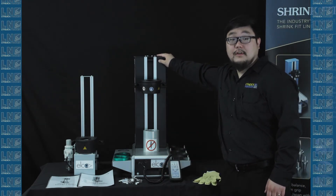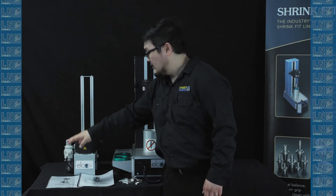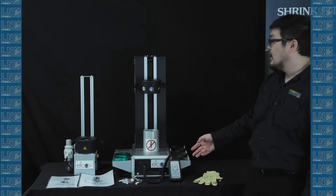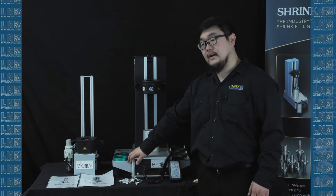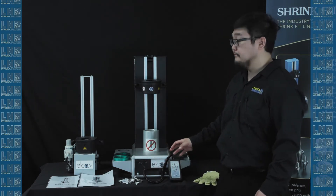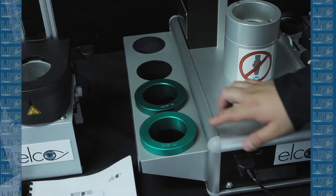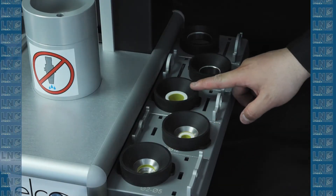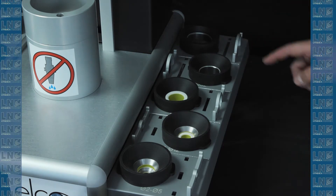Your Stark II shrink fit unit. Cooling tower. Instructions for both shrink fit unit and cooling tower. On the left side of your shrink fit tower, you have your taper pot rack. On your right side, you have your cooling rack. On the left side, you have two taper pots of your choice. On the right side, you have five heat induction rings and five cooling brackets.